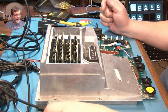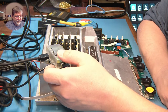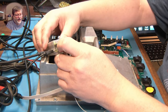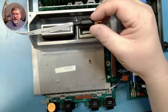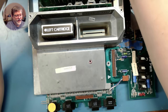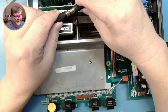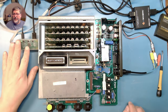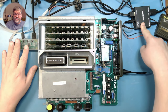The next thing we need is an upscaler. I have here an RGB to HDMI — this one contains the analog sandwich board interposer board, so you get this six-pin analog connection. You can buy these cables from Copper Dragon on his Tindie store. Connect that cable into the little pigtail coming off the GTIA digitizer and coming out of the 800. Because the RGB to HDMI doesn't handle audio, I'm also using an audio injector for HDMI.